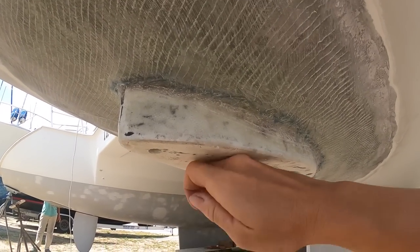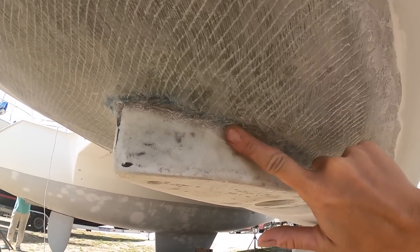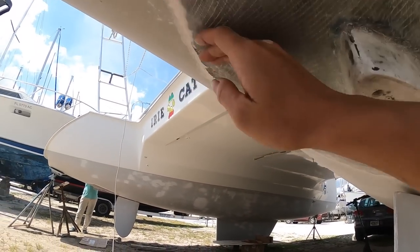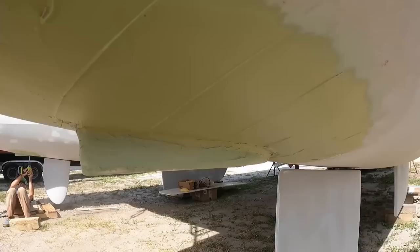It's been a couple of days since we put the plugs, as Davey called them, into the boat. Since then, Lonnie and Terry have put a few more layers of five-ounce cloth going down the side just to tab it in a little bit more, and then they put one more big sheet of 1708 all the way around it again — so that is pretty freaking solid now. You can see the fair and fill is going on, we're attached to the hull, nice and solid. There's a small amount of fiberglass work left to do which I'll show you in the next episode — that's just to join it together as a plug for the inside to make it super strong. We're also going to put a big backing plate on there, which wasn't part of the instructions, just to make it more structurally sound. Stay tuned — we're also going to be showing you the batteries, the control systems, and installing the motors themselves.